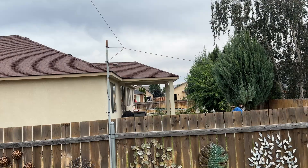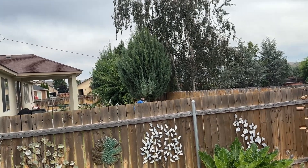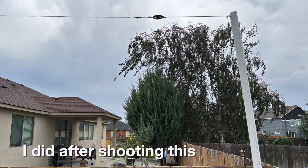At the far end I put up another 10-foot piece of antenna mast and used some nylon line to make a loop to run the wire through where it makes the final 90-degree turn. The last segment attaches to the corner fence post with some nylon line running through the insulator. I'll probably put up a piece of PVC pipe or something to raise the end up a bit.